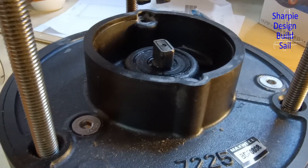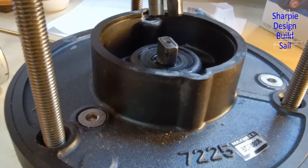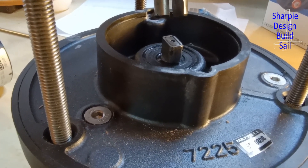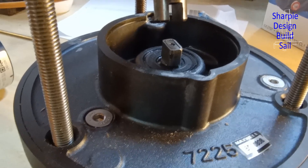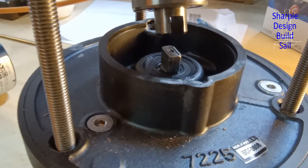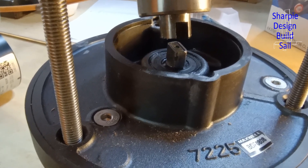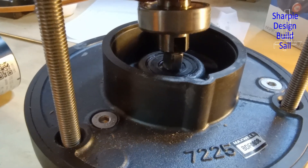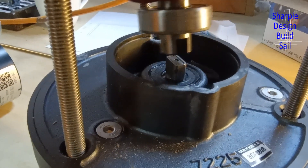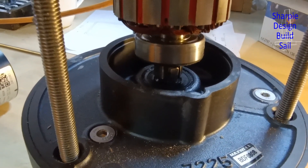That part's finished and it went really well. There was a little bit too much penetration of the weld on the corners — pretty hard not to, it's only a millimeter. It's stainless steel so I didn't really have the right files, but I had to file out the insides of those corners. It's only taken about an hour or two, and it all fits together just like that. I hope I haven't made things too neat a fit, because that relies on everything running really true. The bearing cap that the bearing sits in — as you saw how I machined it — should be really concentric.